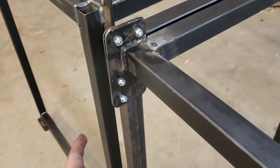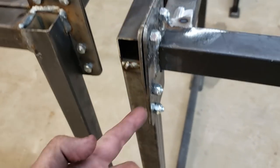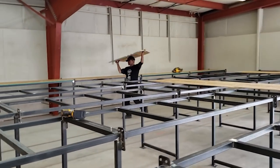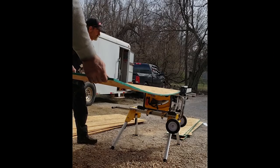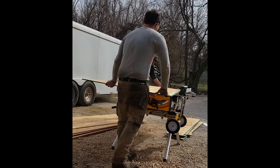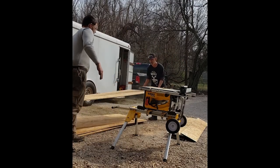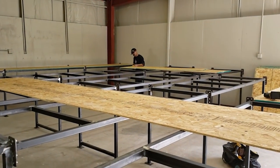We've brought in all the pieces. Our end caps here have the same plate as everything else — a little overkill for the end cap but good enough. These bolt together with five-sixteenths hardware and a lock nut; the strength on that is over two tons, so if these are supposed to hold couches, I'm not worried about it. You can see how these L-shapes now bolt together — matching plates on either end of each shelf piece — and the end caps just interlock. Four bolts was way more than we needed.